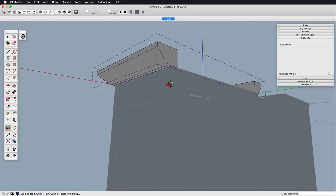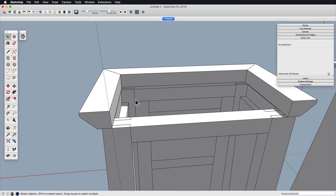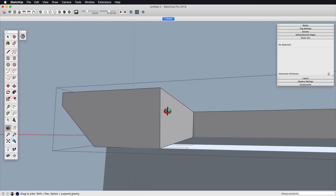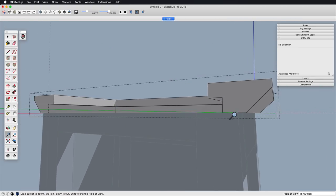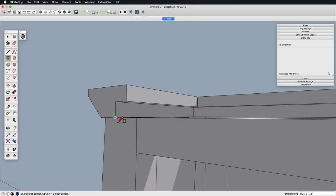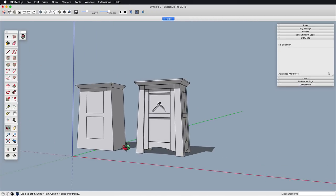So didn't tweak it any further. Just getting a basic idea of how this would be built in pieces, and we cut on the angle. And then I immediately said, actually, this should be a little bit thicker at the top. And it probably wouldn't, if it's on a mantel, you're not going to see the top. So the way I would probably create this is with maybe a half inch depth plywood at the top, or hardwood, but either way, that whole entire piece may not be one solid piece, so at least that's how it was in my mind.